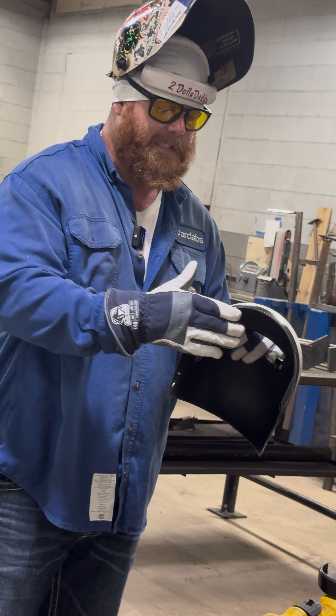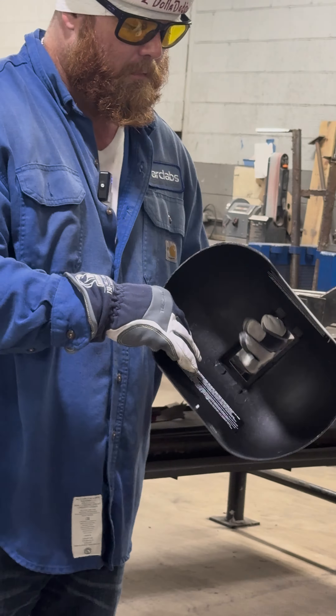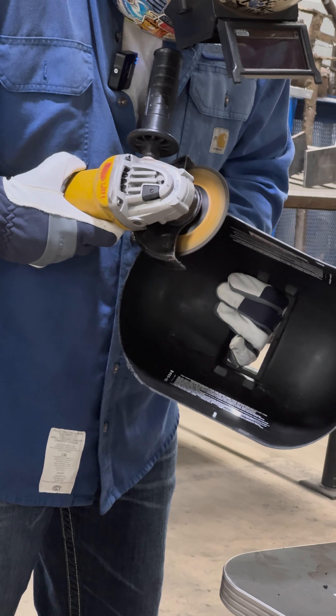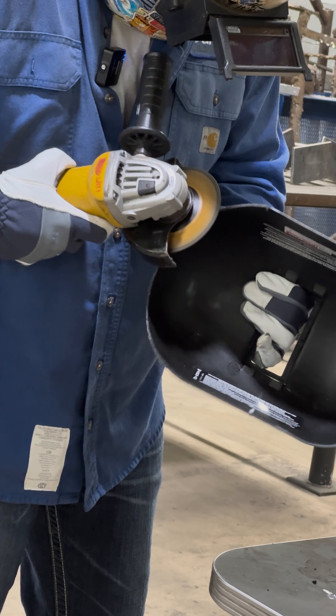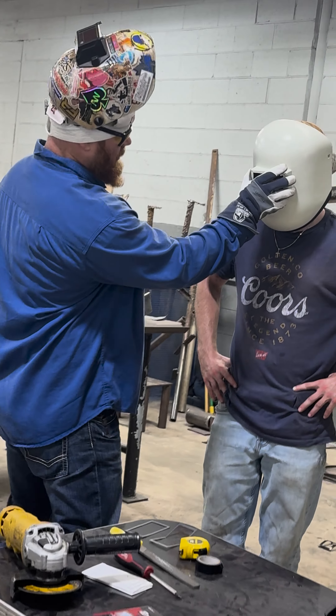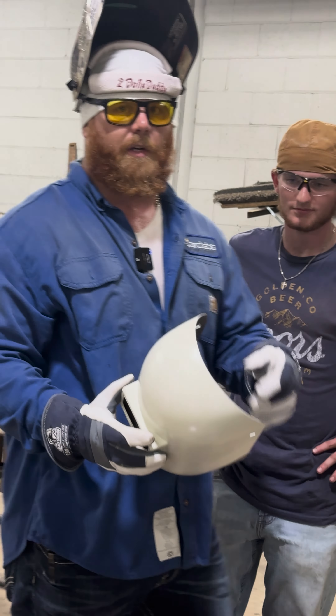To get it perfect, we're just going to go to that tape. I'm just going to take my grinder and run through there, knocking it all down to my tape — nice and perfect. So now we've got an inch off the bottom. Now when he looks through the hood he can bend his head down, so it won't hit him in the neck. There'll be no restrictions there.